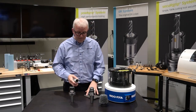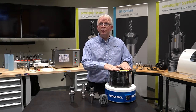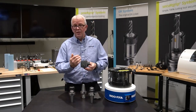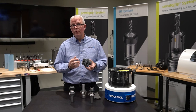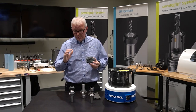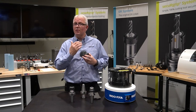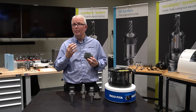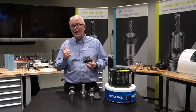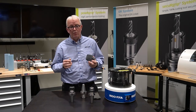That's where something like this comes in — this is a taper cleaner. It has a motorized base and interchangeable canopies. Inside those canopies, I have three different brushes. The brushes are nylon that are chemically coated with an abrasive, and this rubs on the tool holder and removes the corrosion and rust that's on there. But it doesn't remove material — it just glides across, cleaning everything the best possible way. That allows you to take that tool holder, put it back up into that CNC, make it last longer, and it looks a lot better when it's not rusted.